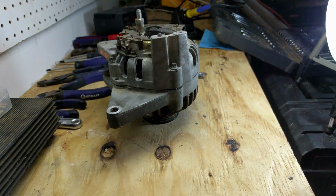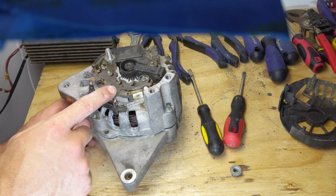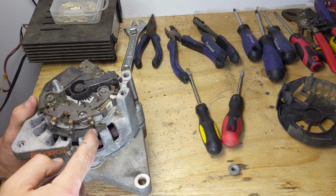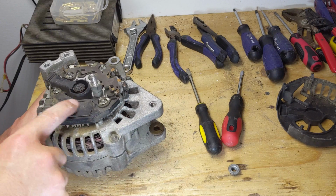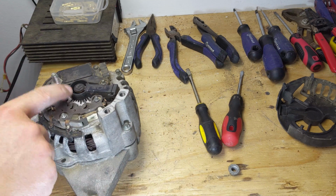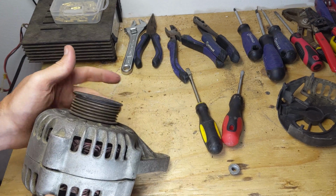So I would need to take this plastic off and this diode rectifier off. Okay, now I'll be taking off this bridge rectifier. I'm going to be cutting the terminals here where the coils come in, and I'll be taking all of this out, maybe even this. And I don't know if you can hear the squeal. Those are the brushes squealing against the center. I think it's called the rotor or the armature. That's the inside of the alternator that spins.